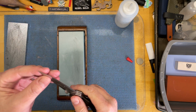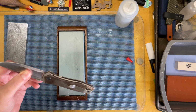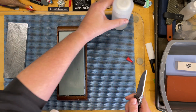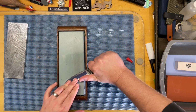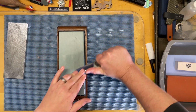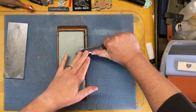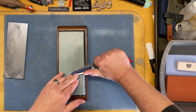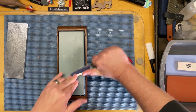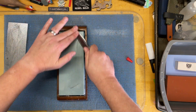the second hardest substance on earth. So only beat by diamonds. So we're gonna do a couple passes on this. I call it passing the burr. I form the burr on one side, and then I'll form the same burr on the other side and just keep removing it back and forth and remove any fatigued metal and stuff like that. And then we'll do some final deburring strokes on this.